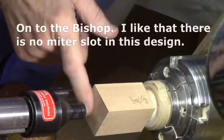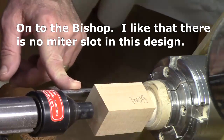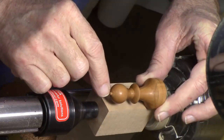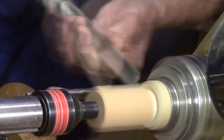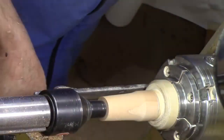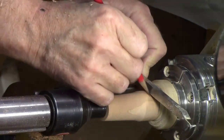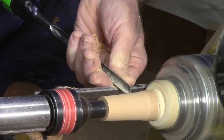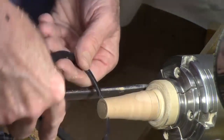Time to do the bishop. I could probably do this without tailstock support but I like to use it. Notice there's no point here to damage the very top of the bishop — it has a beautifully elegant design with this tiny little feature at the top, so the tailstock won't damage that. Again I have a storyboard. I try to avoid measurements if I can find some relative reference, such as this beading tool for the bottom. I brace it, come in here, and just scoop in. These calipers are set to measure 18 — it's just about there.